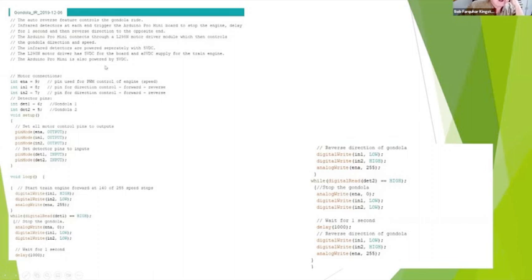But pay attention to your commas and semicolons and equals signs and stuff like that. What you do here with these little two double slanted things, it's good. The Arduino program ignores this. This is just for your use to find out what you're doing with it and why. So you can see that here.